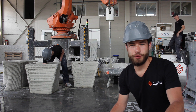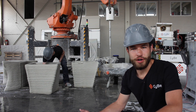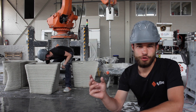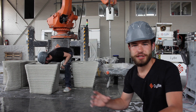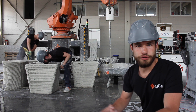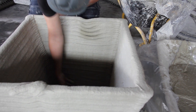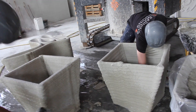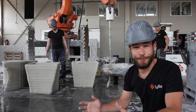The print was successful. Now you do the cleanup process — you have to empty the hoses by increasing the water content and the additive to make it more flowable, and then you put these little orange balls through the hose; they clean everything out completely. We did a little bit of processing during this print by running a sponge over the layers to give a smooth finish. There were also a couple of issues with the first print: it was going a little too fast so the layers were a little bit thin, and the additive was maybe a little too liquidy — this caused a little bit of a collapse. But for the second flower pot we were able to slow down the speed of the printer and increase the solidity of the mix, which made it come out much better than the first one.